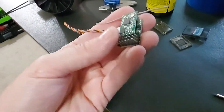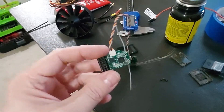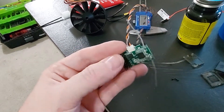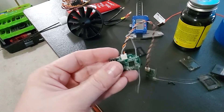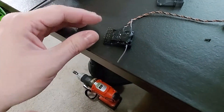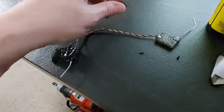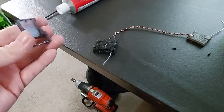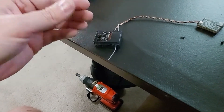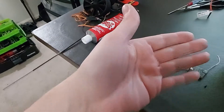We got the cases taken apart because this is a multi-layered PCB board. You really want to make sure you jam liquid electrical tape into every crack and crevice. What I like to do is plug in a bunch of servo connectors so I don't have to worry about getting it all over those connectors, and then you can just layer it on. We got them both completely layered with liquid tape. I put the case back on one and we'll put the case on the other. Honestly at this point the case is almost kind of pointless, but it looks nicer and it'll be easier to mount with double-sided tape. So we'll get these put back together and our receiver situation is done.